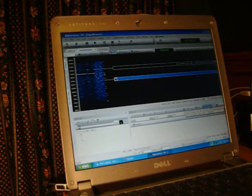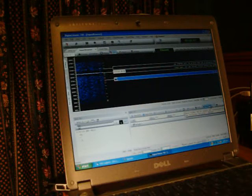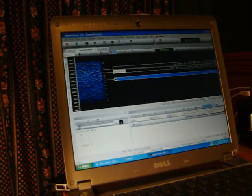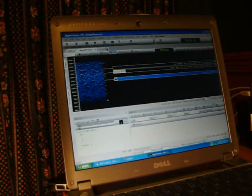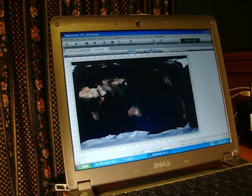Okay. Oh, I just noticed we see there's YU7AU. I think that's in Yugoslavia, but I'm not sure. There's also F4FFH. Now the time is 6 minutes past 9 in the morning in Australia, so receiving both France and I think it's Yugoslavia is not too bad. If we have a look, I think you'll find that's grey line. Yep, see the grey line there? And Australia's not too far away. So most of the propagation that I actually work is grey line stuff.